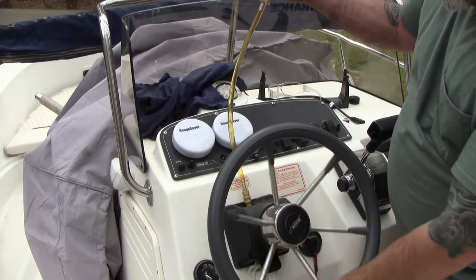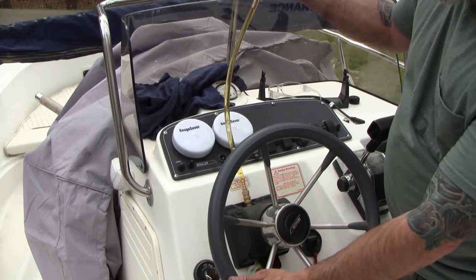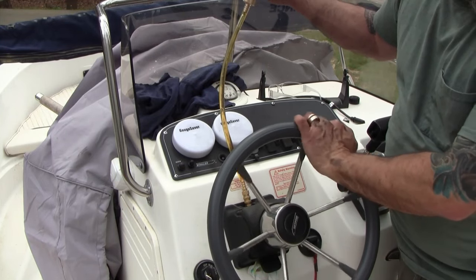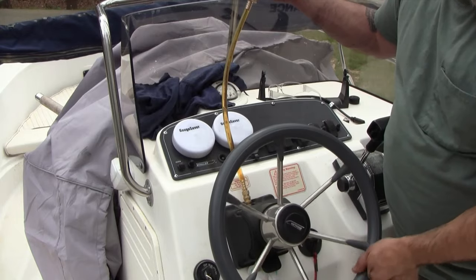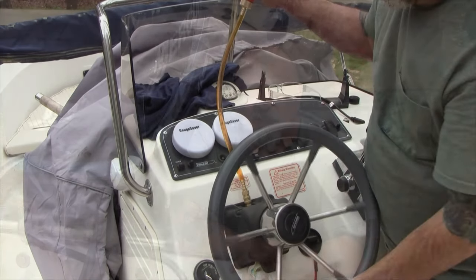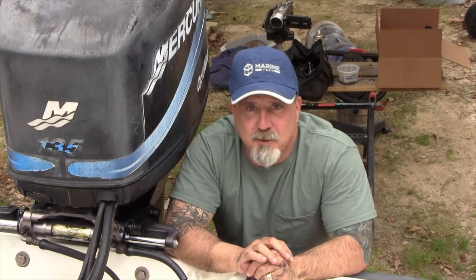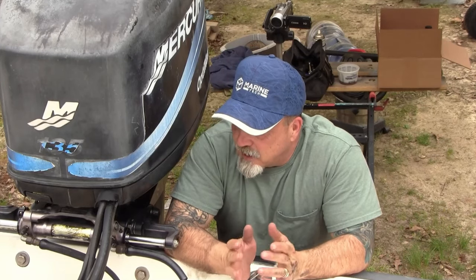Here I'm doing just a few final turns, making sure there's no air in the system and ensuring it's all purged out. Once that's done, I'll close up those brass nipple valves in the back, disconnect the hose, seal everything up, and then test it to make sure there's no side-to-side play. That's it — we've got the seals replaced and we've purged all the air out of the system using the tools from Marine Tech. A special thank you to them for sending them, especially to Matt, who also sent me this hat. If you like this video, hit share and like, and don't forget to subscribe. Thanks for watching.